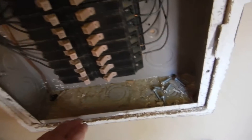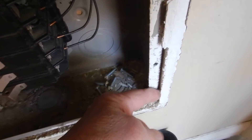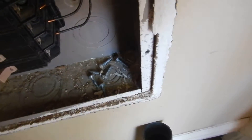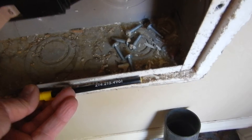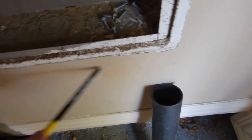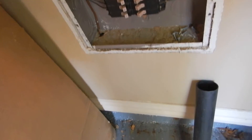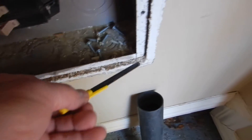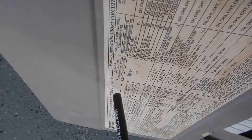See 'flush cover' — the way this cabinet is mounted inside the wall, it is not flush. The cover cannot fit flush. We have more than an eighth of an inch gap. So if something goes bad in this cabinet, heat and fire can work their way around the cabinet cover. It's not only code — the manufacturer also considers that a pretty good idea.